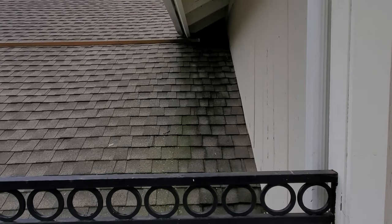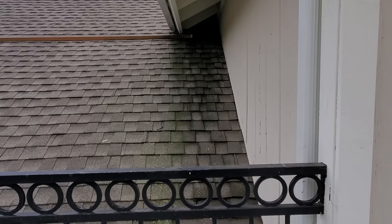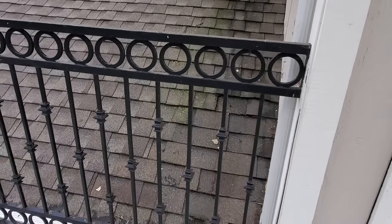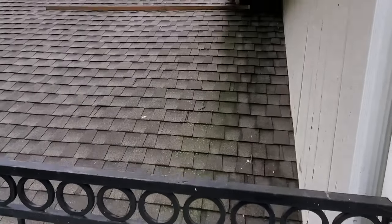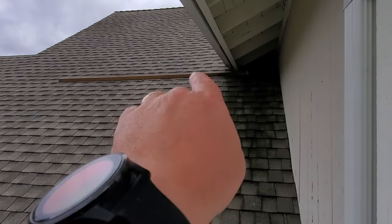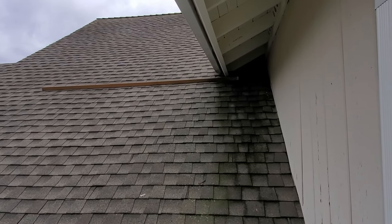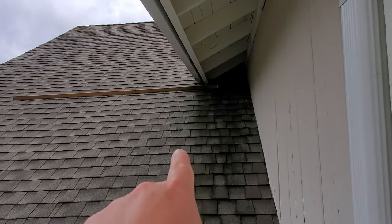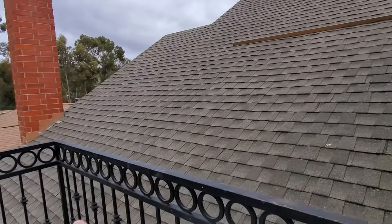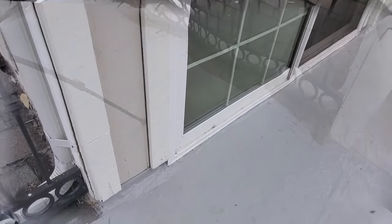Good afternoon — it's Friday, the day I originally intended to release this video. You just watched me observe the water coming down from up here and going right over to where the original crack was. One thing I'm going to do to improve longevity is adjust that board to more of a slant, so when water drains off the upper roof onto this lower roof it funnels off the side into the gutter instead of onto the balcony.